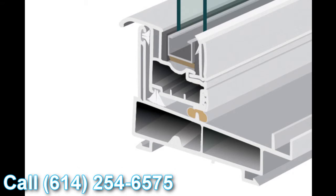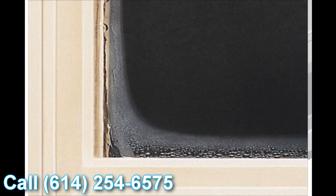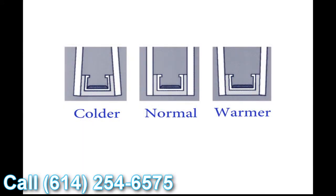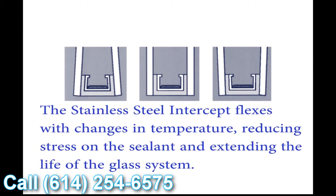With this window, we use the stainless steel intercept system as standard. There are a couple of different types of intercept systems — one is tin plated and the other is stainless steel. We've made the decision to use stainless steel standard on all our products. The great thing about stainless versus tin plated is it conducts a lot less heat and cold, so condensation resistance is significantly upgraded. Another added benefit is the U-shape design the intercept uses. When the glass is glazed to the intercept, with the different temperature fluctuations we all experience throughout the day, the glass and the seal expand and contract — meaning seal failures are greatly reduced using the intercept stainless steel system.